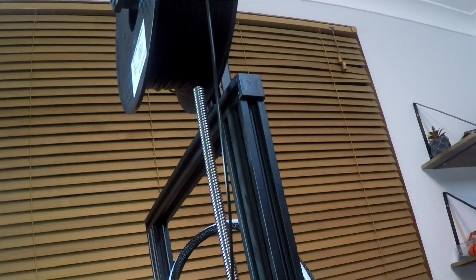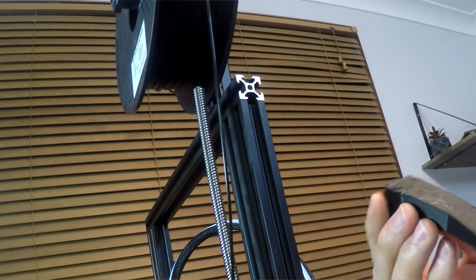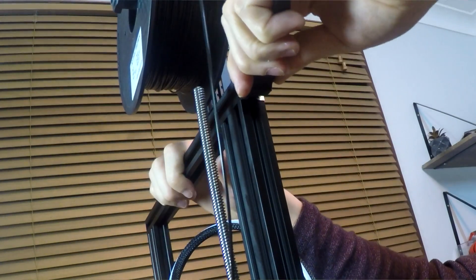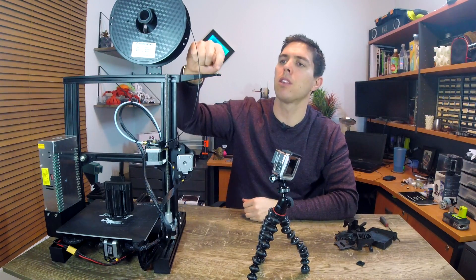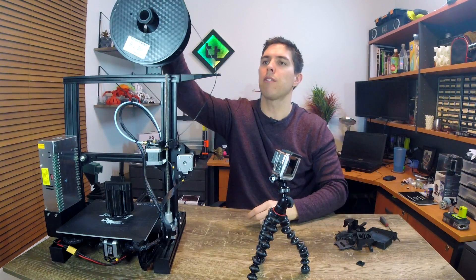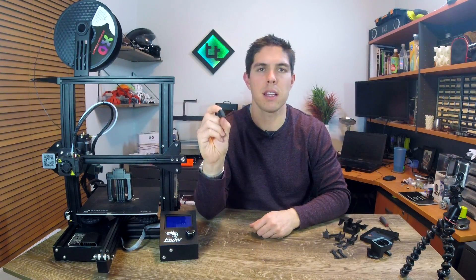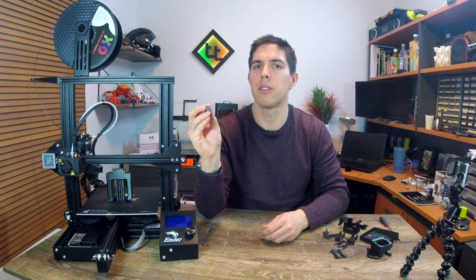The next stage is up on the printer. First we remove the little bung from the end, then this one simply slots into its place — the flat side faces up, which curves the path closer to where the filament will be. Align it carefully and push to clip it in. I've opted for the version with the slight cutout, which is much more convenient; now the filament even when pulled hard still has a nice curved path on its way to the extruder. In the same Thingiverse link there are also blanks so you can design your own modifications, which is a really flexible approach from the author.